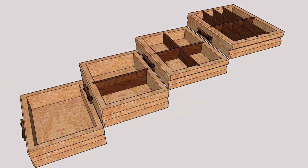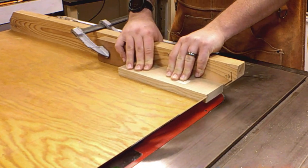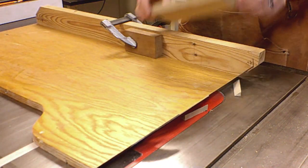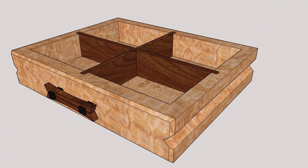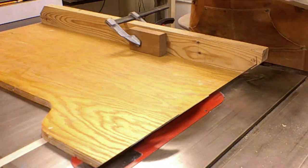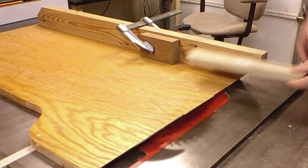The drawer fronts are thicker than the backs and sides, so the first step is to cut the fronts to final length. Then I tip the blade to 45 degrees and use my miter sled with a stop block to cut the miters in each end. I have set this up so there is 1 1/8 inch of material left above the miters — this is where the drawer fronts will get a chamfer detail later. Next, I move on to the drawer back miters: first I cut a miter on one end, then I set up a stop block and spin the pieces around to cut the other end. The drawer sides are done the same way.